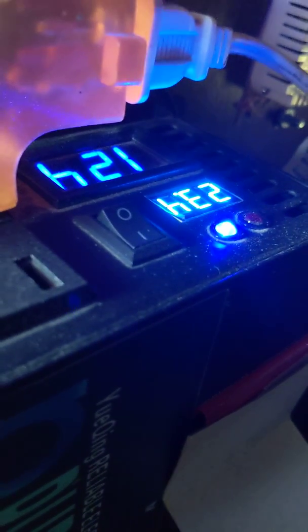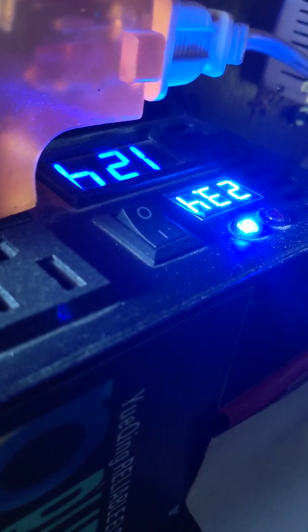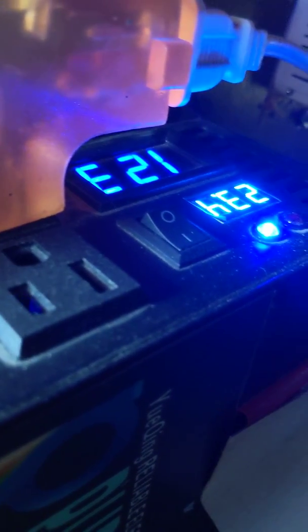Here, let's look at the numbers up on here. So that 124 is my voltage, 123, whatever. I have 124 volts available for the plug-in, each plug-in does, and the battery voltage is at 23.4, so it's inverting that 23.4 volts of DC current into 124 volts of AC current. These two plug-ins on the face of it, those are those two numbers.